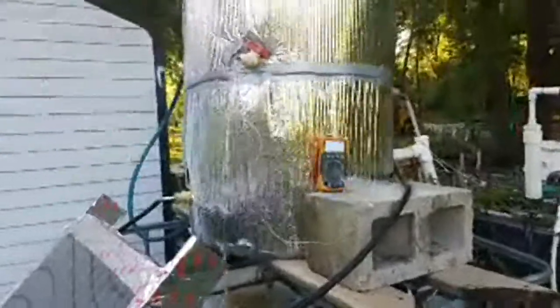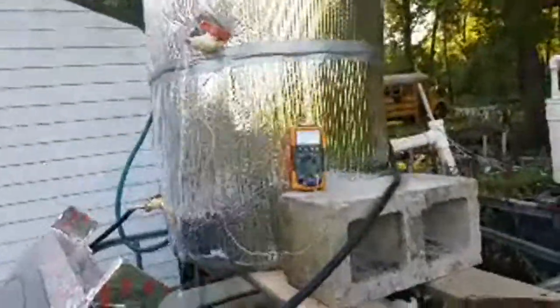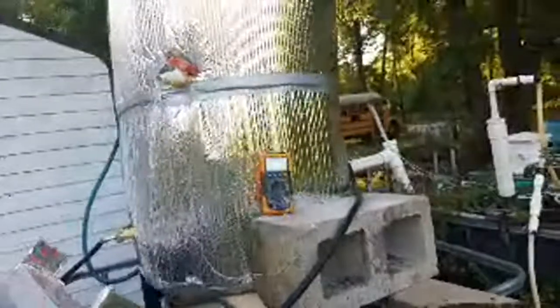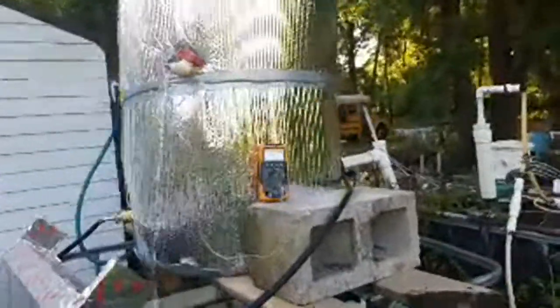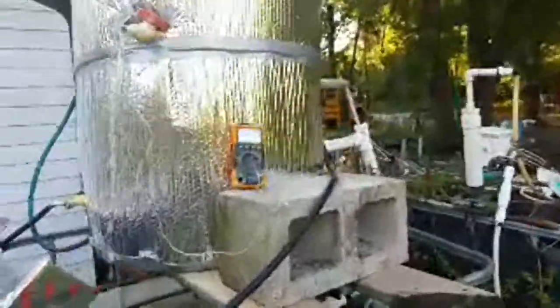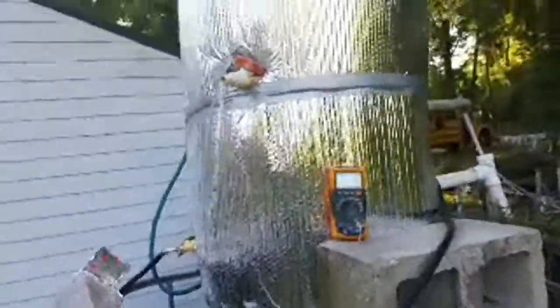So there we go. Still waiting. We're at 30 minutes, so that's about 26 minutes of hot water that we've seen. It never dipped below 106, got to 107, then we turned off the cold water coming in, and that's why we're able to double the length of time that we had from when we were using it with 1 day's sunshine. So that's pretty cool.